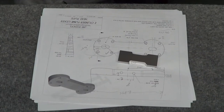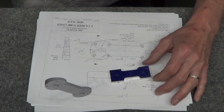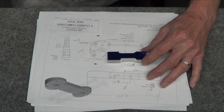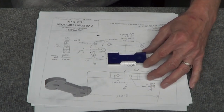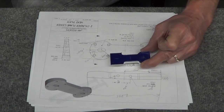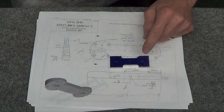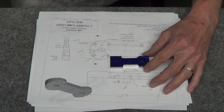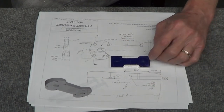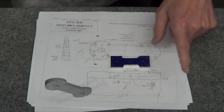Oh, just starting to attack this guy. And this is the first time I've used DeCAM to get the layout. Kind of weird, scary. Clamp it in the vise right there. Just kind of plunge dive to remove a lot of the material here with an end mill, and then in, back and forth. I'm going to make a scribe because I'm using an X-Acto knife to draw the lines.